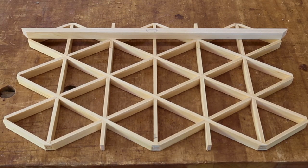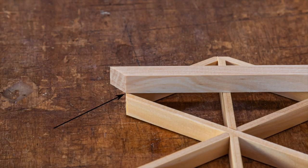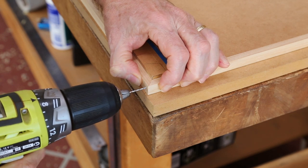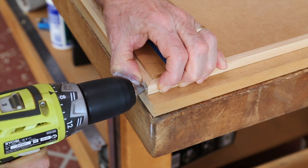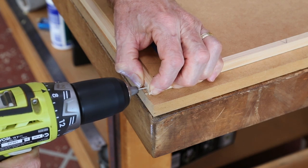The next and final step before the patterns is attaching the Tsukeko. Have a look at the dimensional diagram and cut all Tsukeko pieces over size. Place the cabinet maker's triangle to indicate top, bottom, left and right. Then trim the ends on the 45 degree jig until the inside mitre lines of the Tsukeko are perfectly lined up with the edge of the respective joints — the bottom with the bottom, top with the top, and the sides with their respective sides. I cover this process in some detail in book 4. Place each of the mitre pairs on a flat board and against a block with a 90 degree corner and drill 1.5mm pilot holes in all mitres from the sides Tsukeko. Don't apply any glue at this stage.